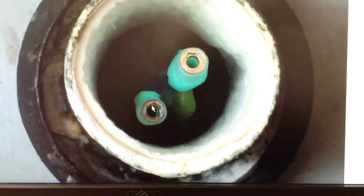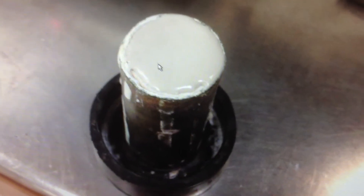All this is is a plastic tube and I've modified the shape with wax. That's the sprue on there — this is just a reservoir to aid with the casting technique. That's it being placed in the ring. That's the casting ring there with the pieces placed in it.